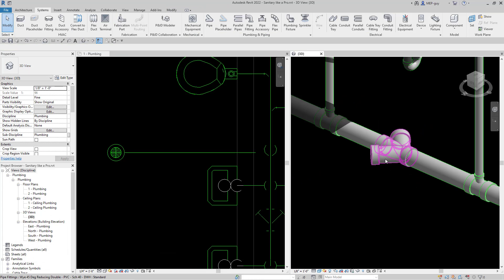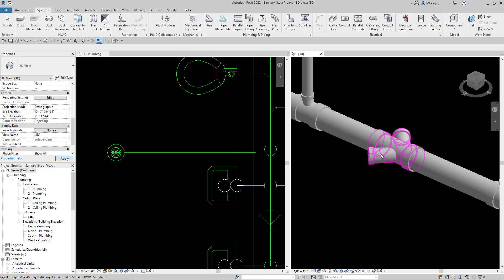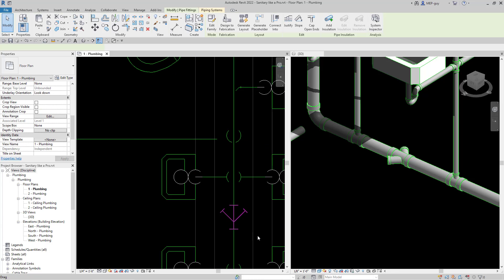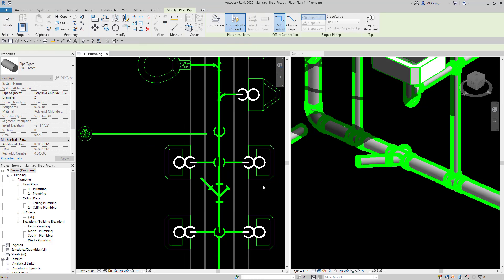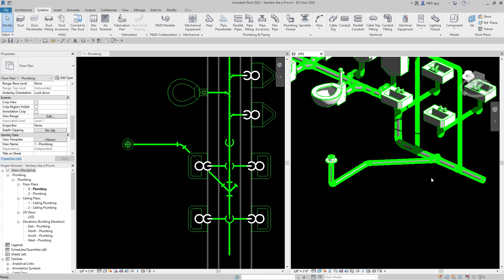I'll hit escape and make sure these pieces are only two inches to match my drain. Going to nominal radius three, I can make that one inch so it reduces the fitting parts on this side. Now let's go from this fitting right here, zoom in, right click, draw some pipe, turning on thick lines, and we're going to go 45 degrees to a point right there. Now that I have this line already drawn, I can just use trim extend by hitting TR, click a point right here and a point right here, and Revit will automatically route that piece of pipe.